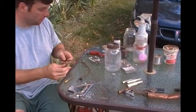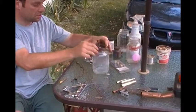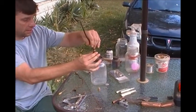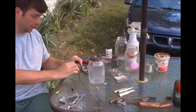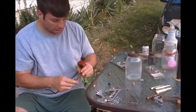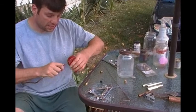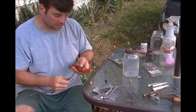Like when you come up to a compressor — let's say this is our compressor canister, it's a sealed canister — and I want to hook a flare nut to it and put a flare on it. So the first thing I'm going to do is take my cutters, cut back on the pipe — not too short, just enough so I can get a nice good edge — and then ream out the inside and clean it so that it's nice and clean.